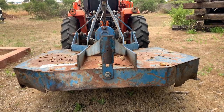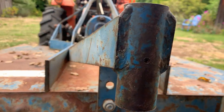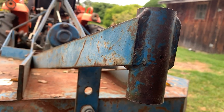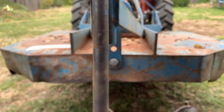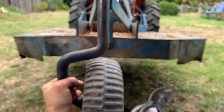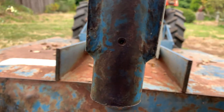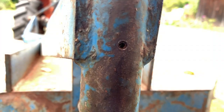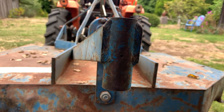I'm looking at the neck that holds the shank, right there. It slides up in — you have your wheel. This has been bent back straight; it looks fantastic. I'm going to try to clean up this zerk fitting. It looks like it was broken off. I might have to drill it out, tap it, and insert a new one. Then we'll be able to grease this neck here on our rebuild.